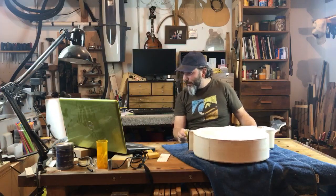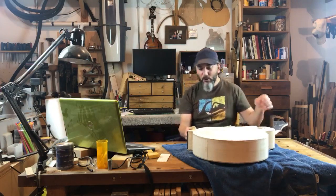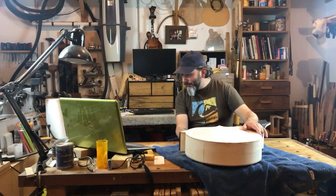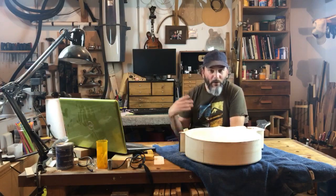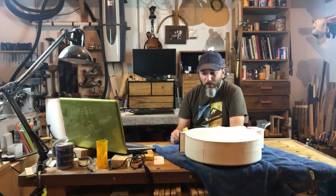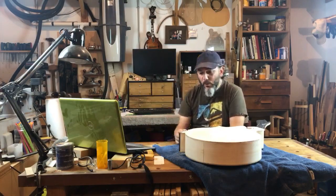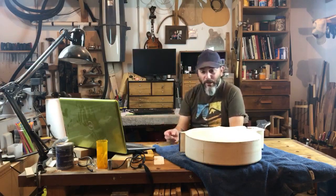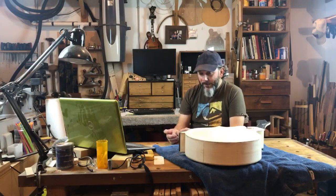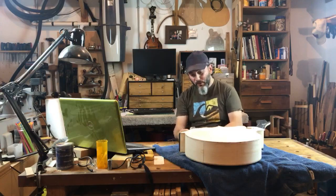So Adam is saying that he's been doing some French polish on some furniture, and he's been enjoying the look of it being new again. Yeah, I really enjoy French polish, and the more I do it, the more I enjoy it, because you don't have all those lacquer fumes in the shop, and you don't have all that overspray everywhere. I can open my overhead door partly, or close it, or fully open, and it doesn't matter. The finish applies quick, and it dries quick. It gasses off pretty quick too, and it's just a pleasurable process to do French polish.